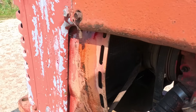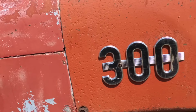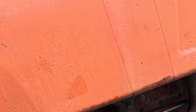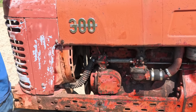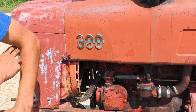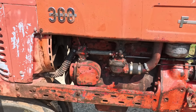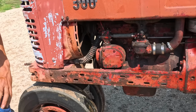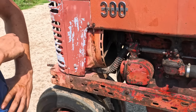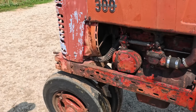Where's the antifreeze coming from? Oh, your overflow. Yeah, I got it pretty full. Not like popped off, but like, yeah. Now, have you seen any activity on your temp gauge? No. So it probably doesn't work. Doesn't work. I would get that fixed. Yeah. Soon. So you can be sure you're not overheating. Make sure your thermostat's working.